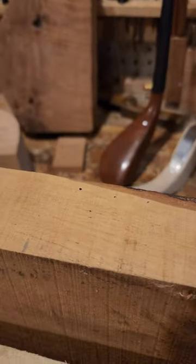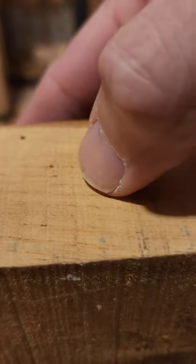As a crude test, you can take your fingernail and put it on the corner to see if you can make a mark — and I'm making some marks here on this maple. Now here's some persimmon, and this is only two inches thick. On the persimmon, you don't really see any mark — you can barely see something. So that's a crude test, but not a terrible test.